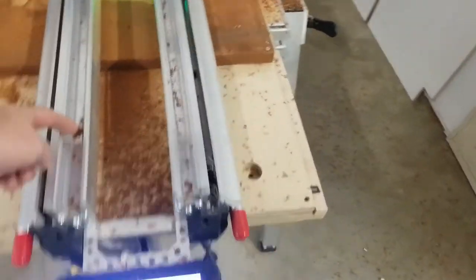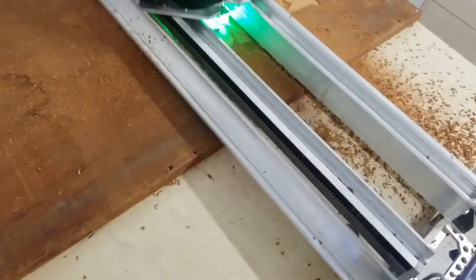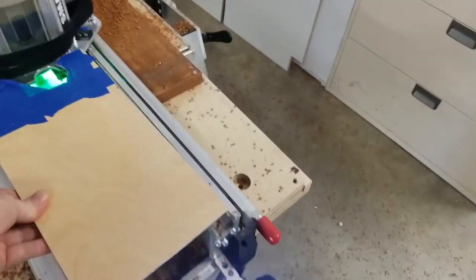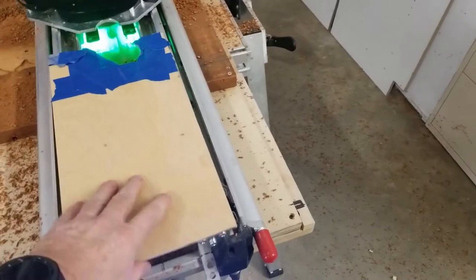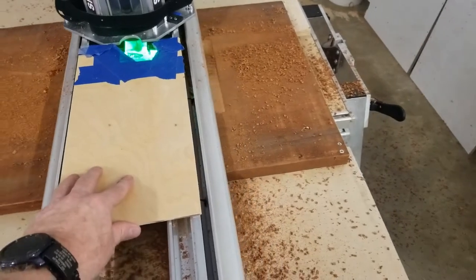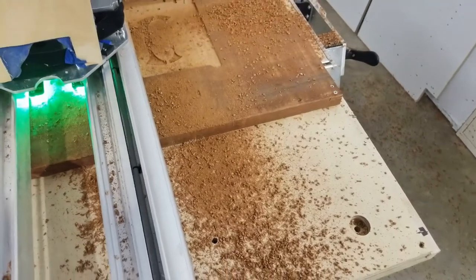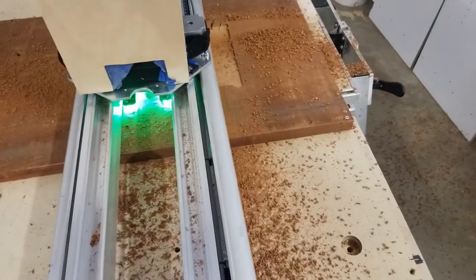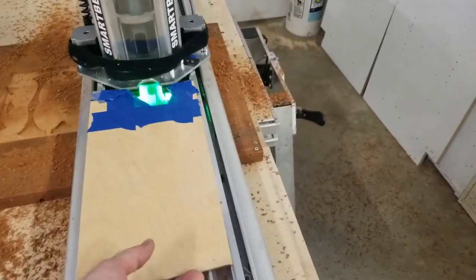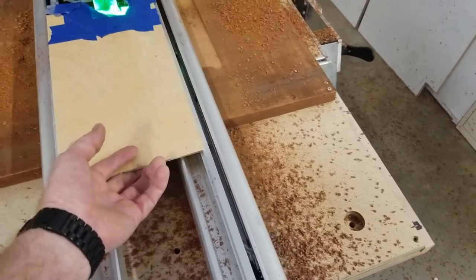You'll see I'm getting a lot of debris up here in the track — I don't want that, so there are options. I can hook up my four-inch dust collector, or I could cover it with some panels. An early customer of ours made covers out of clear acrylic on magnets — he could put them up, make adjustments, then drop them down. The idea is that as it travels across the X-beam, it covers the beam so you don't get debris in it.